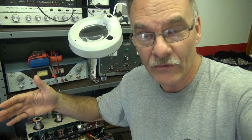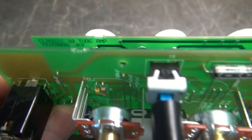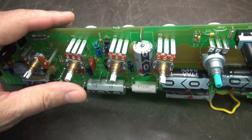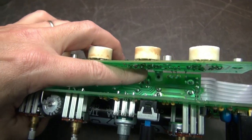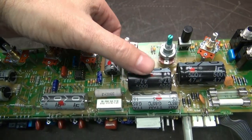So I'm going to tear it down. I'm not going to go through that on the video — all that information is clearly shown on the web how to get this thing apart and back together. But I'll show you the condition of the capacitors and the circuit board, and I'll show the swapping out of the caps, and then we'll hook her back up and hopefully it's fixed. There she is — the Classic 30 tube amp circuit board assembly removed. It actually came out a little easier than what I expected. I noticed they've got little right angle brackets down here for the tube board, so you've got to be very careful not to flex that, or you could crack the circuit board.